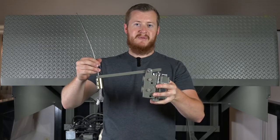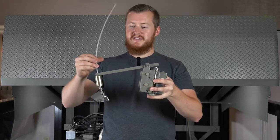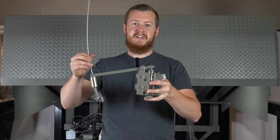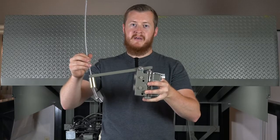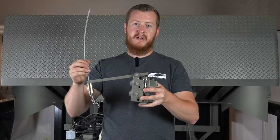There are adjustments that can be made if you notice that your lip is not extending or extending too early. You can adjust the cable weight and its position relative to the lever arm to compensate for improper lip timing. The second adjustment that can be made on the logic block is the down speed control. We will cover both adjustments in detail in this video.